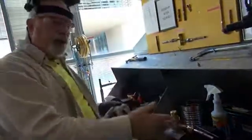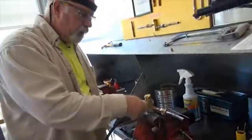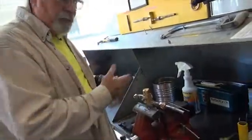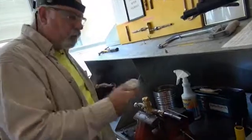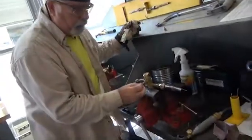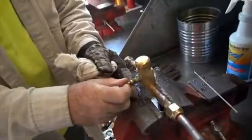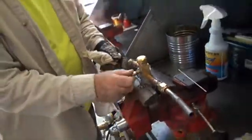The only difference is you're going to do it on both sides. Always check your gel and be sure you add more before you do the other side if needed. I recommend getting both sides set up, then get checked out before doing the second side — don't do both at once, because the first one may not be well done. Please take your time. Now I'm putting the Schrader valve back in — that's what you want to do when you're done. Put the cap back on.